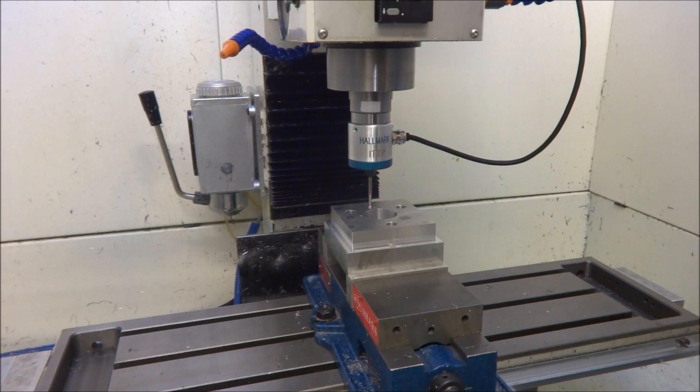Or I was jogging into the work trying to set something up, pushed the wrong button, and had a crash. It happens to most of us quite frequently when we're new to CNC or just not doing this on a daily basis. So this impact tolerant touch probe feature was what really drew me to this particular probe. Most touch probes are prone to having faulty indications — carbon builds up on the contact points and causes false readings, so you have to take it apart and clean it, and for some probes this can happen quite frequently.